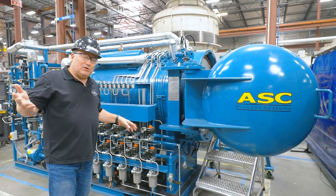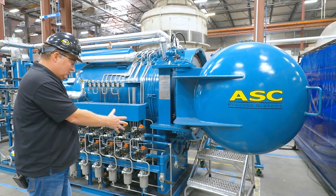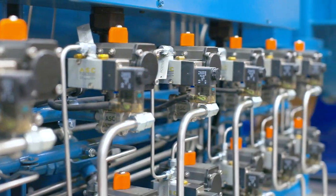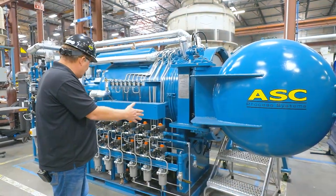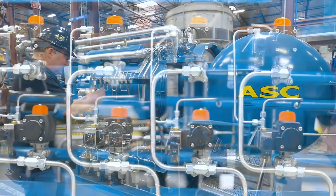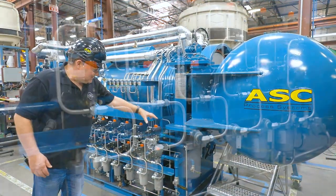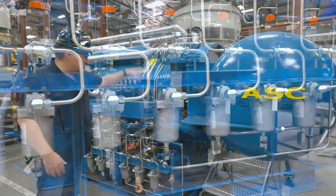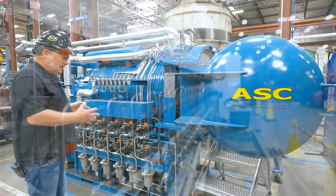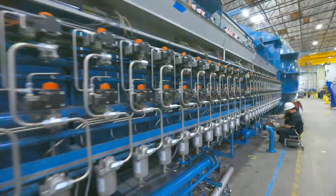As a new recruit, one of your first plumbing jobs is likely going to be to make an entire vacuum system like this. This is what we call the vacuum valve rack, and every autoclave has one. This autoclave has six valves, or six vacuum lines, and each vacuum line represents a couple of valves, a resin trap at the bottom, and a bunch of tubing. On the larger autoclaves there might be 40 or 50 different lines, so there's a lot of plumbing work that goes into this.